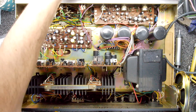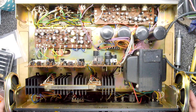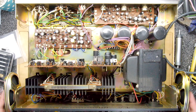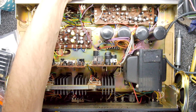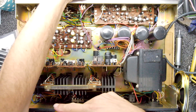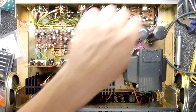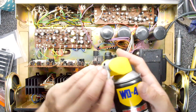I've got a hissy audio, so I'm just putting my hands on these speakers to make sure I can feel the cones moving. I might get an oscilloscope on those later to make sure they're outputting the same voltage and that one isn't actually weak. As I play the volume control - you might be able to hear that crackling noise. Most of that crackling is coming out of the left channel. So I'm going to turn that off - we don't want to get electrocuted. Unplug it.